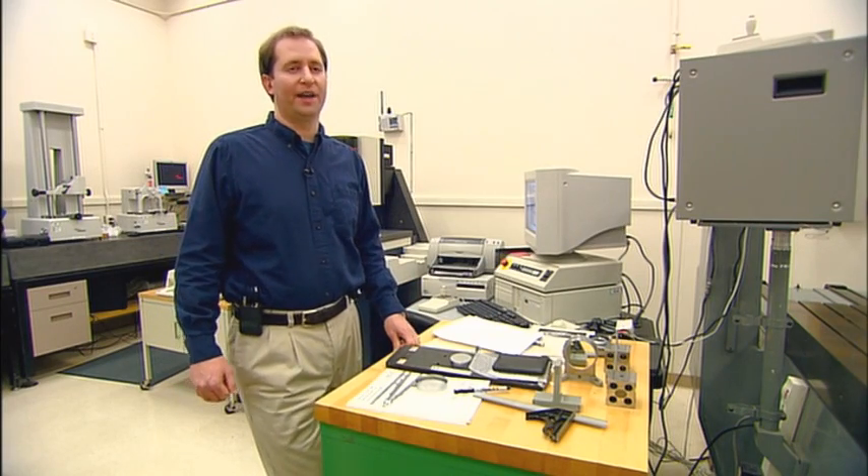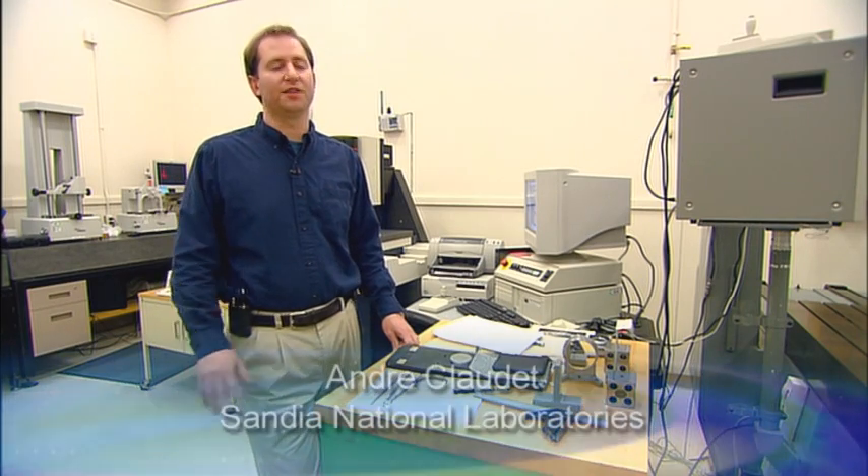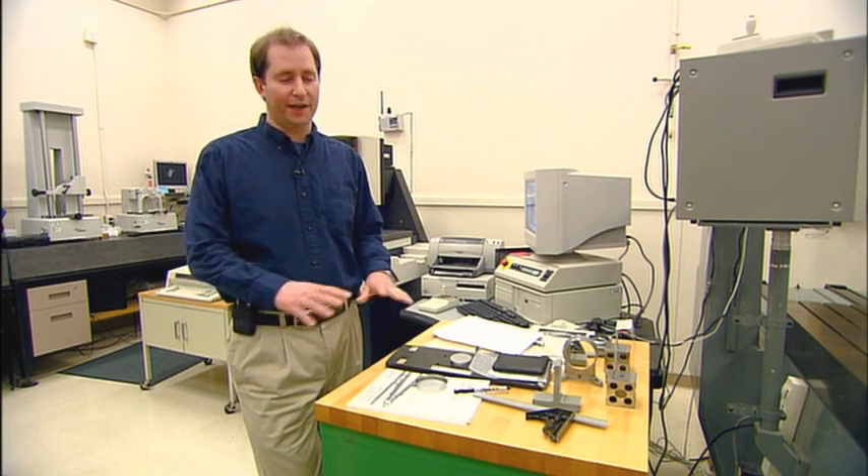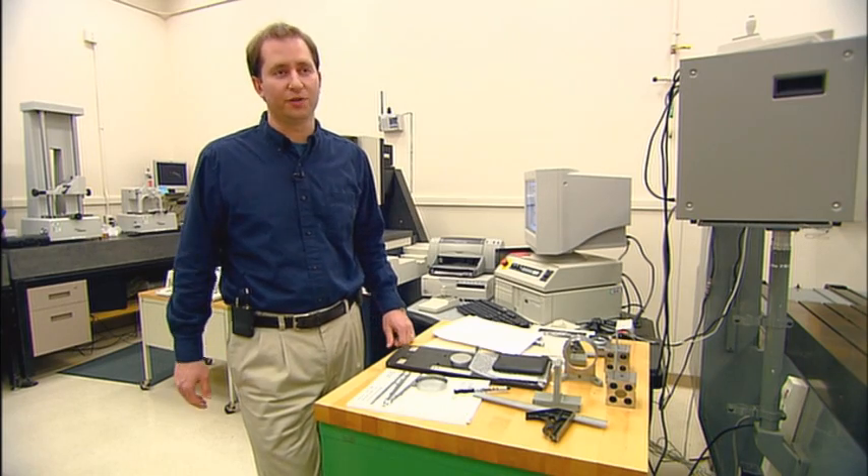These are made by silicon bulk micromachining, where you can pattern geometry in two dimensions and then put it in an etchant. The etchant is very selective — it etches along certain crystal planes to make these particular geometries. So when we define the two-dimensional pattern, we can create a three-dimensional structure.